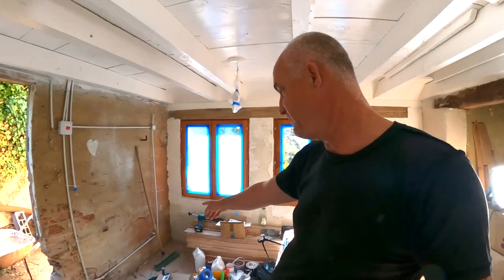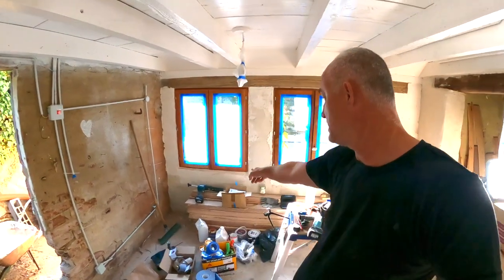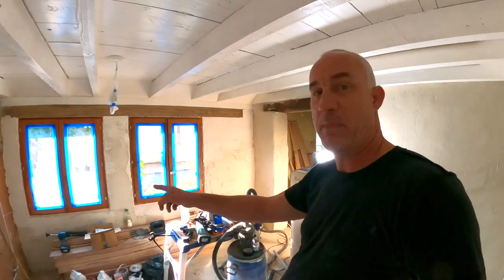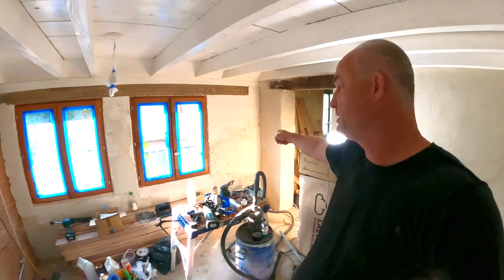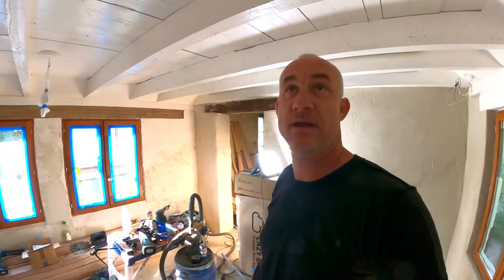Yeah, that's gonna work. Maybe I should divide the one in the corner there, make an outlet there, but then run a cable alongside this wall, maybe behind the kicking board, so that I have power on that wall as well. It's gonna be a double door fridge over there. Yeah, you cannot have too many outlets. Better invest a little bit more time and effort now than regret it later. I might do that.